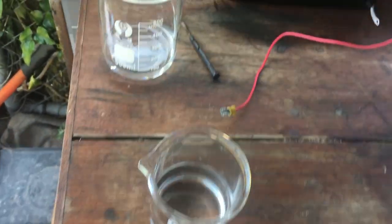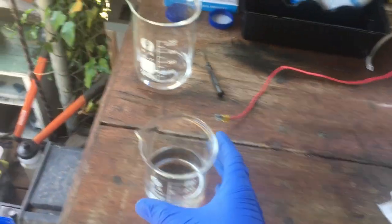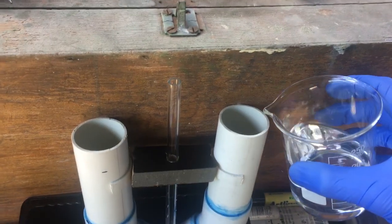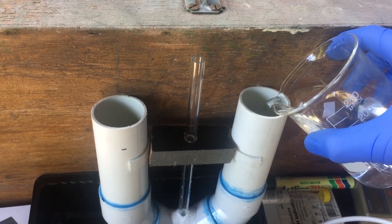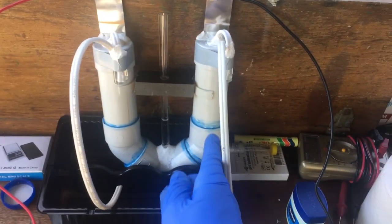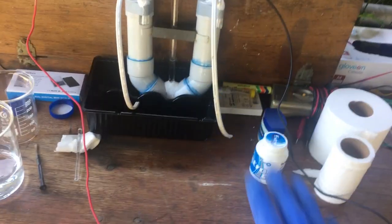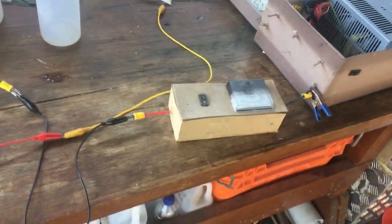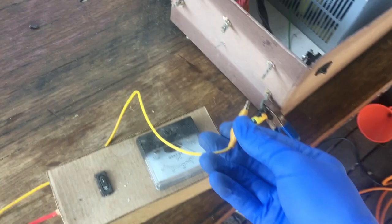The sodium hydroxide solution is made, the cement has dried, and the electrodes are ready. All that's left is to pour the sodium hydroxide solution into the electrolysis chamber — hopefully nothing bad happens. After waiting for ages for the water to permeate through the chambers — which indicates that our membranes are doing a good job — we are finally ready. We've got it all hooked up to the power supply; we've even got a current meter. We're going to start out as we always do, connect up to 3.3 volts, and see just how much current we can get out of the thing.